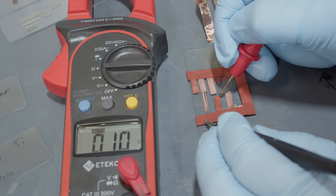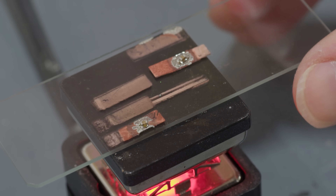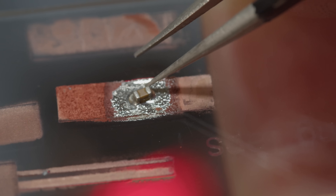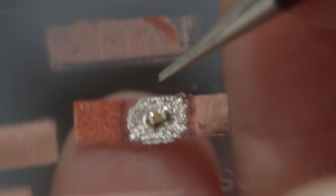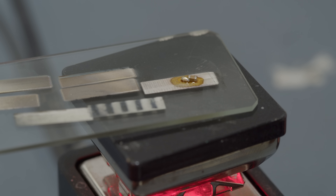Some of the better copper samples are conductive enough to electroplate on top. Using a proper electroplating bath and a little more process refinement, I think you could get a really nice coating. It's also thick enough to use solder paste and solder surface mount components directly onto the glass, which is pretty cool — adhesion seems pretty good from poking at it with tweezers. I did try soldering to the silver samples directly without electroplating, but that just didn't work at all.